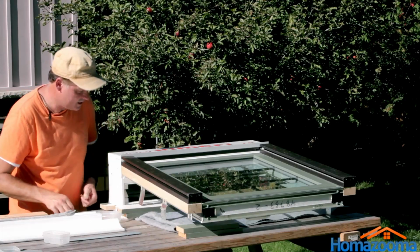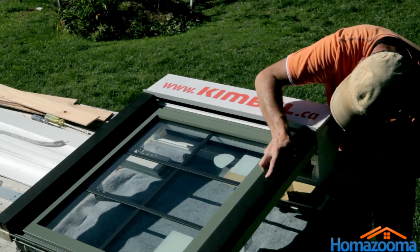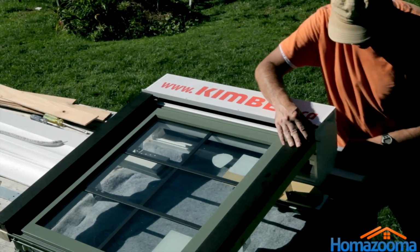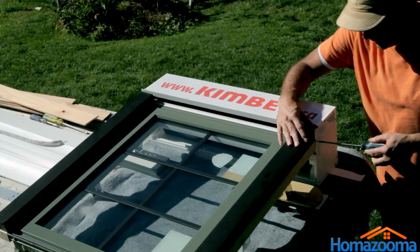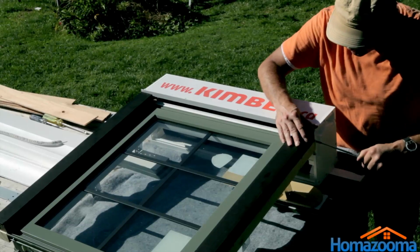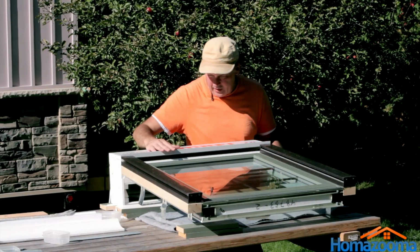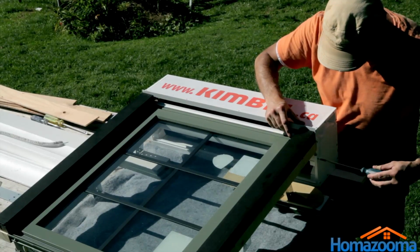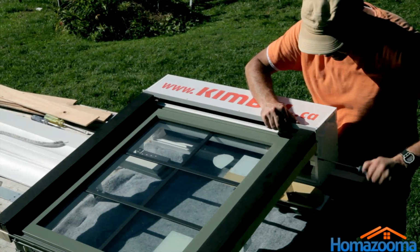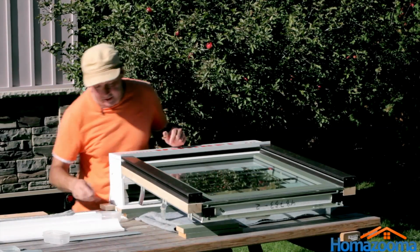Now let's just do the other side. There, that just lined up beautifully. Again, because I leveled the box with the window. What this does, more than anything else, is make sure that the shutter will exit the shutter box, I guess I would call it, and enter the track very straight and properly every single time. So this is not structural. That's why you don't have to over tighten it. It's mostly an alignment issue.